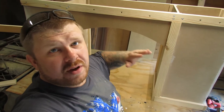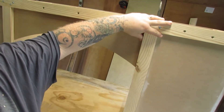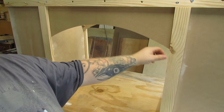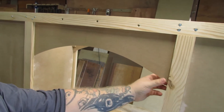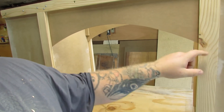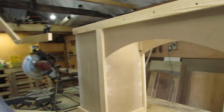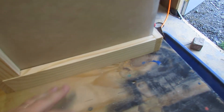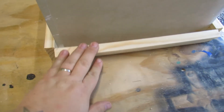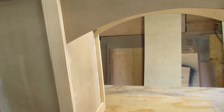Okay guys, so I cut out all the trim — everything except the corners. The base trim down here is cut, and the trim running from top to bottom to cover the seam in the arch is cut. I figured that would also help stiffen it up. I was thinking of a way to attach it — I can shoot nails here and here to get it fastened in. All this is just cut, nothing's attached yet, so I'm going to attach it all now. I didn't film the cutting because it was just simply cutting one-by dimensional lumber to length — pretty easy.